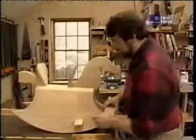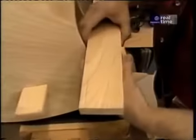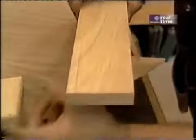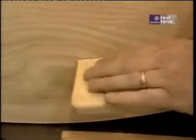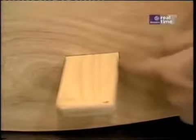The next thing I want to do is start working on the footrest. Now, it starts out as a piece of 1x3 ash. It goes all the way through. Because it's slightly tipped, this angle is a compound angle. It's less than 90 degrees. It's about 2 degrees, in fact. And I'll cut the ends of my piece over here on the miter box.